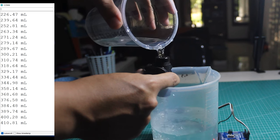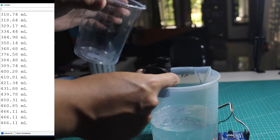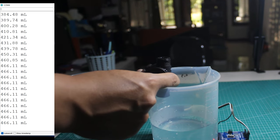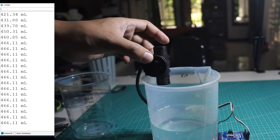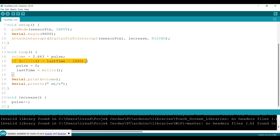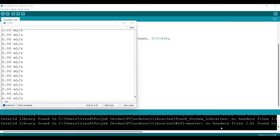The next question is how to measure the flow rate. Flow rate is how much volume passes per unit of time. For example, we can use milliliters per second or liters per minute. To get milliliters per second, we use an interval of 1000 milliseconds or one second, then reset the pulse count after each second. The result gives us milliliters per second with a one-second refresh time.